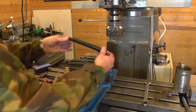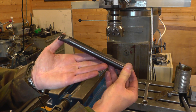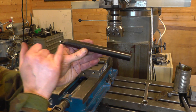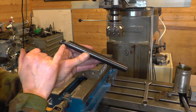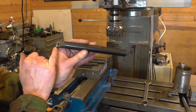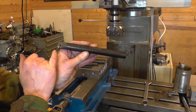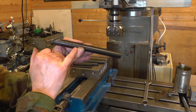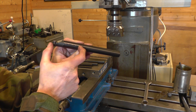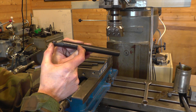A nice feature of the 20mm bar — which is very smooth, smoother than any of the others — is that I think it's been through some kind of post-processing, because there are very little tooling marks in the pocket. They've also engraved a scale on it so you know how far you are into a bore.